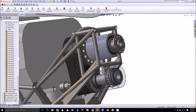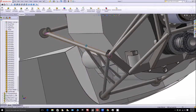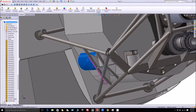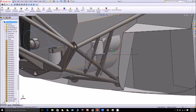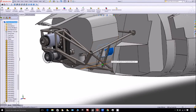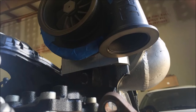Meanwhile, Mark's been finishing off the specification for all the separate parts that make up the belt drive system so we can start putting those together and getting the custom pieces milled. He's also been working on a couple of changes to the engine mount to simplify it. You can see pretty much what the final design will look like, with the air conditioning compressor placed to ensure no collisions with the engine mount, the alternator, and four engine mounts total.